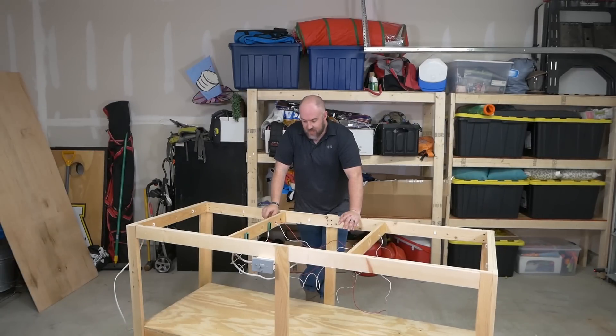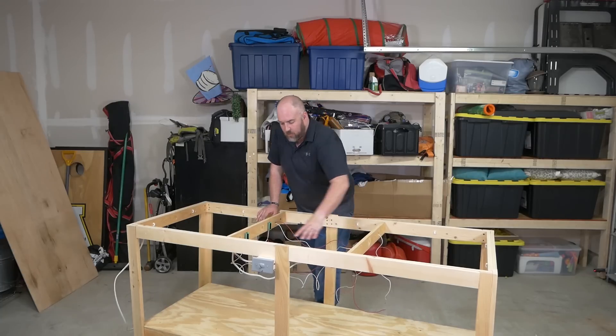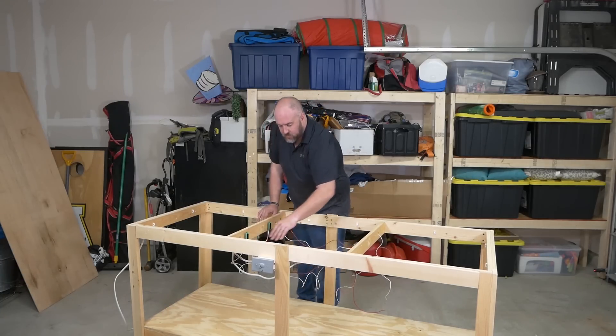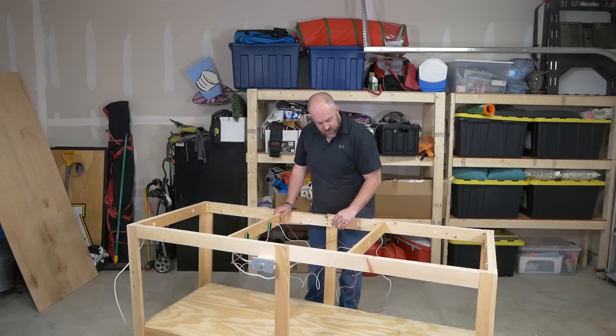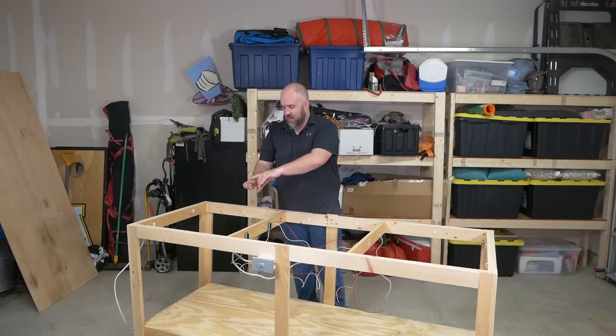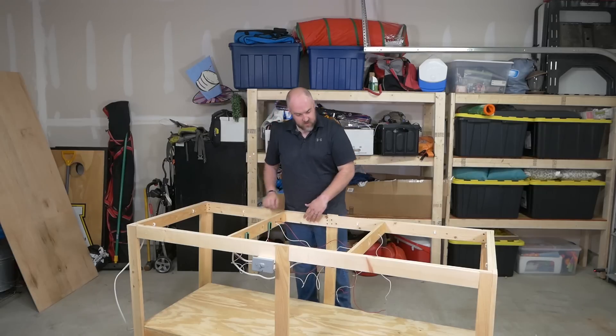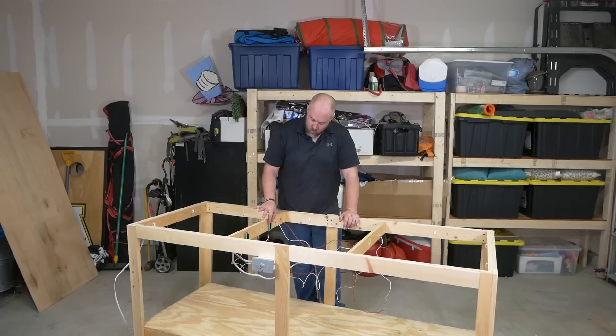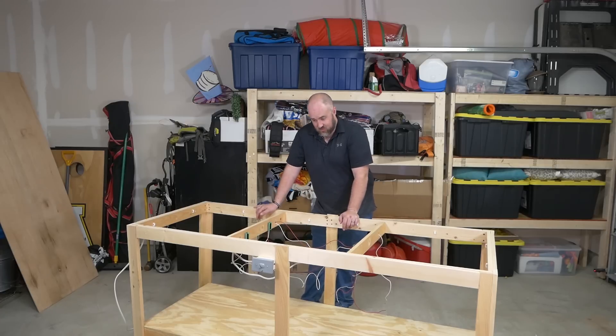That was a lot of work, but that's the base of the power systems going on the layout. What we have here is our master on-off switch that we created and wired up, attached to a power bar. We have our DCC++ system, and we have the DCC bus line run. We also have cable clips all the way around so we'll be able to run different wires, and we have the Arduino Nano shields where we can pop Arduino Nanos on and wire up our different control systems. That's it for the base of the wiring.